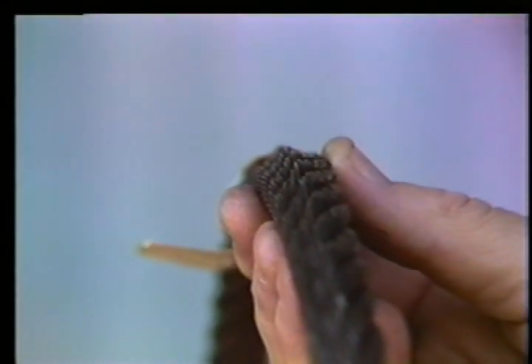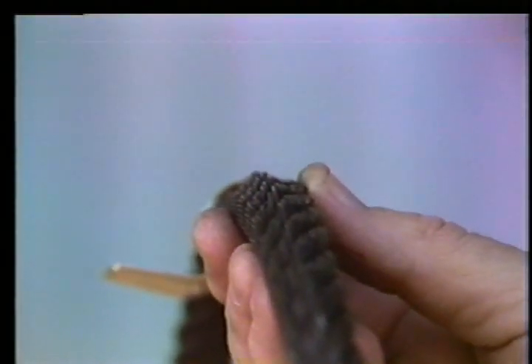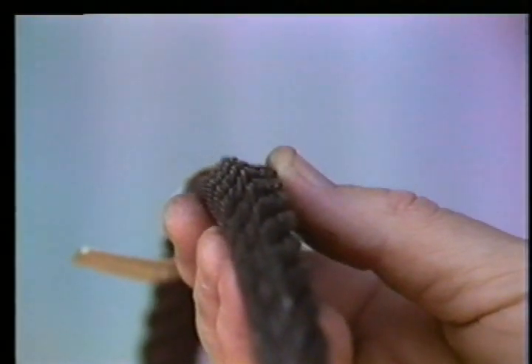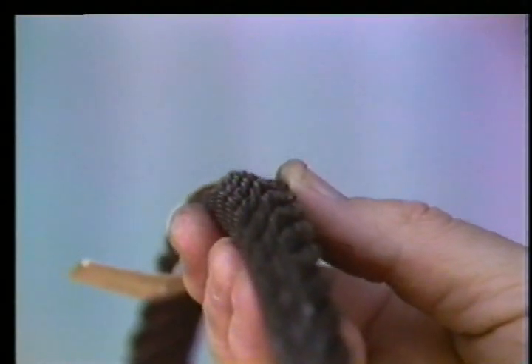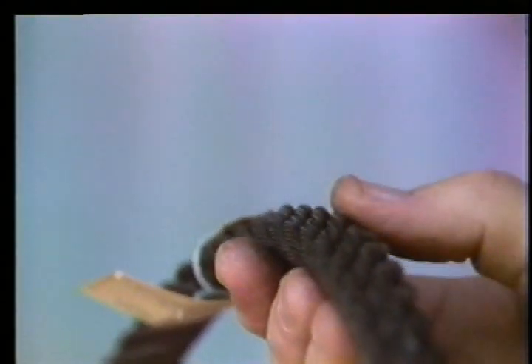This is an obvious case of drum crush, where extreme pressures have been brought down on this particular wrap of rope by an additional wrap of rope above or below. This rope becomes unsafe immediately. The typical application is over-winding on the drum and then crossing the line.